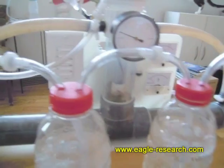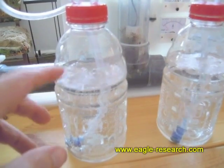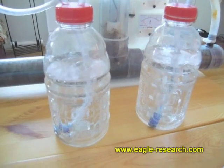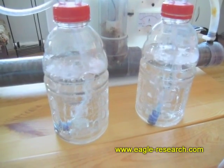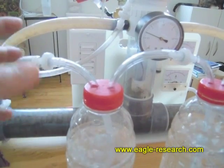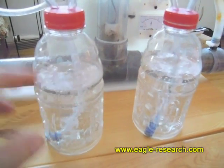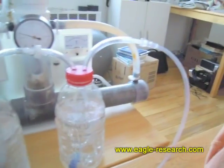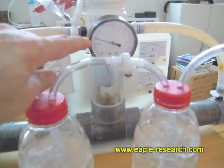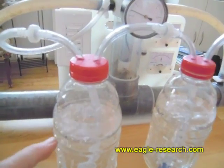You don't want any foam coming out and getting into these bubblers. I use deionized water in here, so I can actually drink this water as a water drink after I've bubbled it for a while. About an hour each is fine — after an hour, change out the water. That way, any residual tiny amount of lye that would cause pneumonia-like symptoms if I was breathing the Browns gas would get scrubbed in the bubblers. That's nice clean Browns gas coming out the end. The pressure is looking like about three-quarters of a psi to overcome the various resistances of the water levels, check valves, and so on.